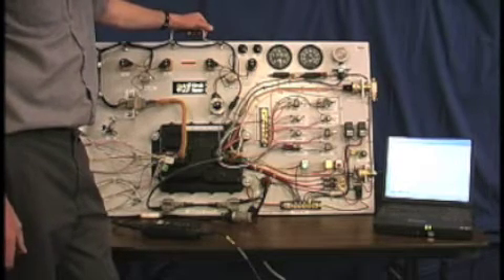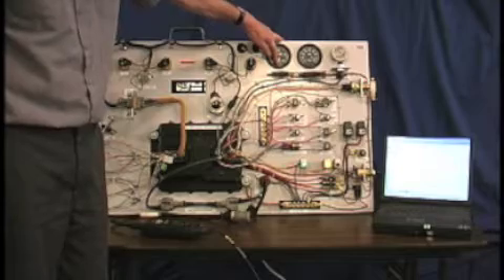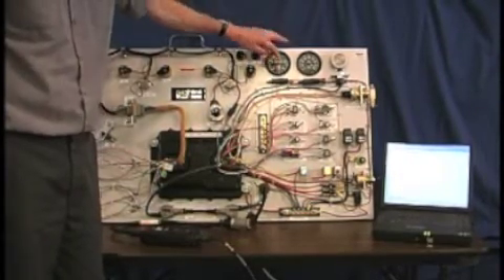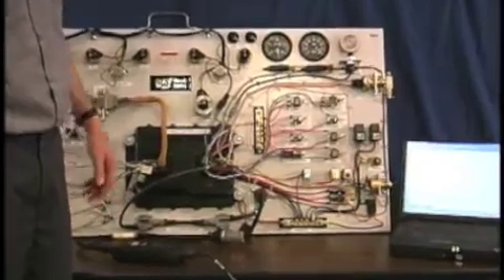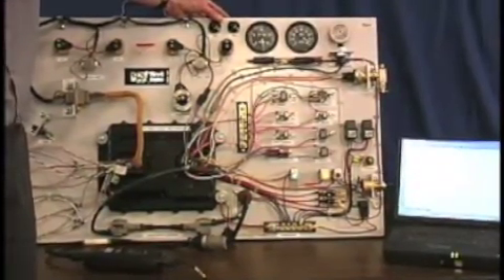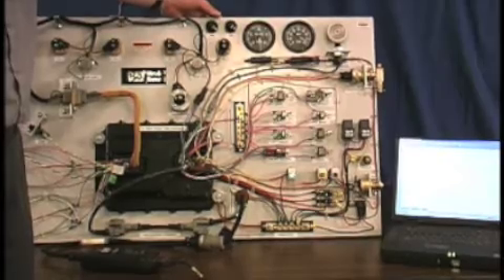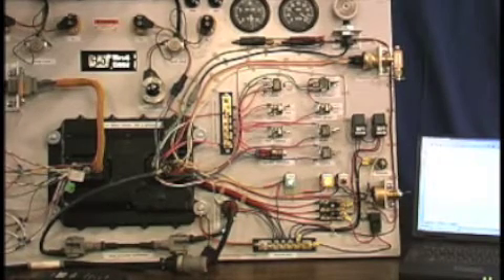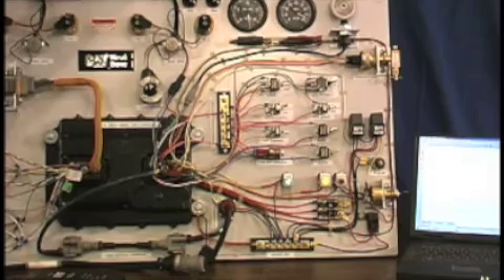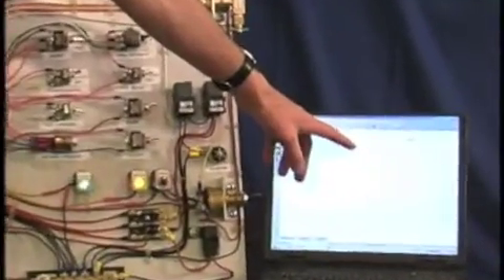This is one of my favorite things to do. We're going to take on a full load dyno run. What I've done right now is I've actually over-speeded the engine — you can see that it's well over 2,000 RPM. Redline on this engine is about 2,100. I've got full throttle, and the way I put a load on this engine is to slow the engine speed down using the speed control at this point right here. With full throttle and full boost, what we're going to see on the laptop screen is the engine going into full fuel. You'll be able to see the speed drop, the fuel increase, the torque increase, and we'll analyze the results after. Go over to the laptop screen and take a close look at this graph, and listen to the injector make noise as it starts to go into fuel and lug down.